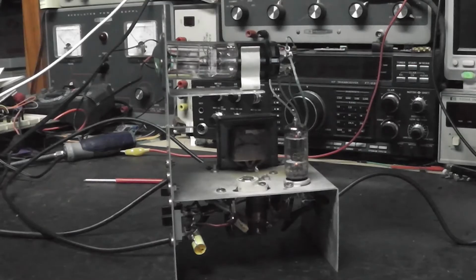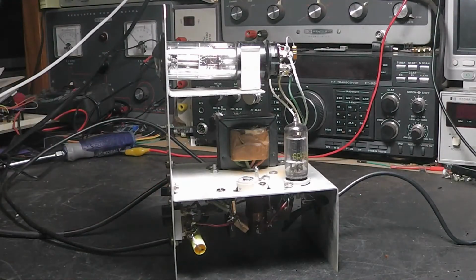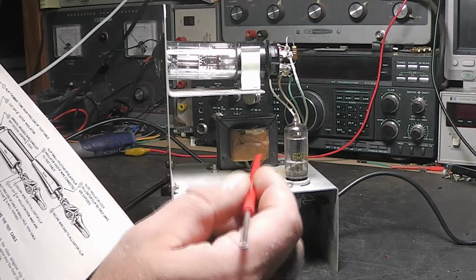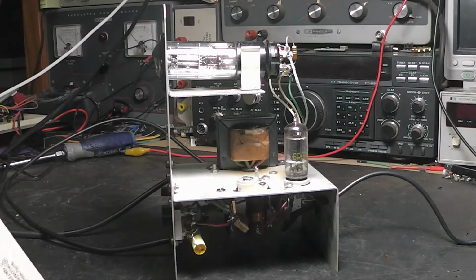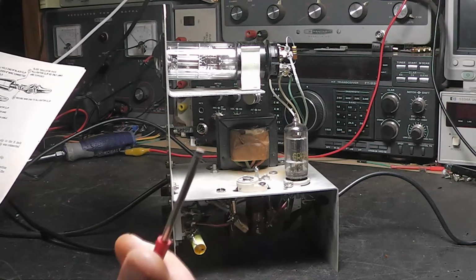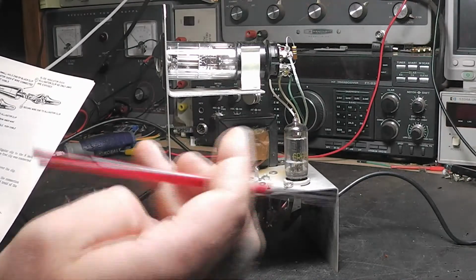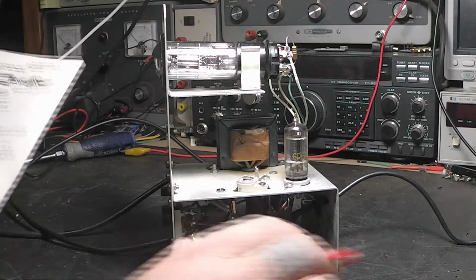I'm going to turn the light back on. But take a tuning tool. I'm going to use a plastic one because some of these can have voltage on up here. Where's that schematic at? This one might not have voltage on it, but some of them can. If you take a metal one, especially if it's metal all the way up, and touch it, you can get yourself shocked. Or if you accidentally touch the metal to one of these side screws, you can.